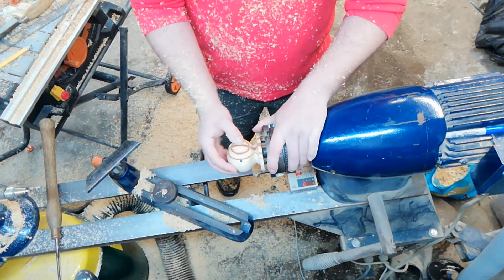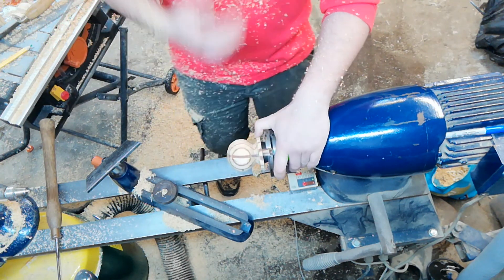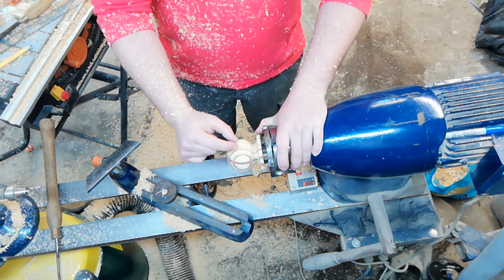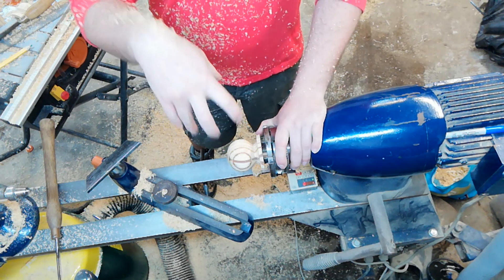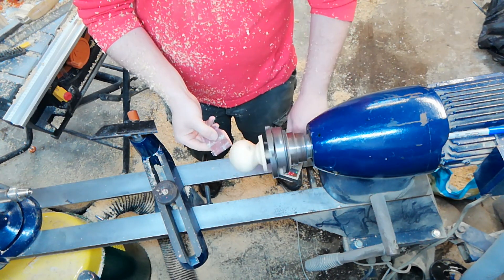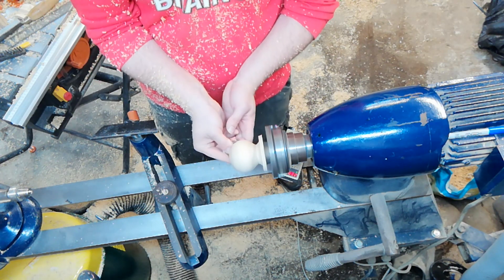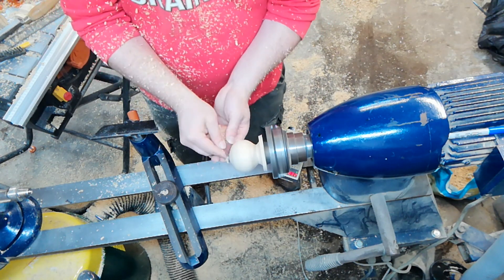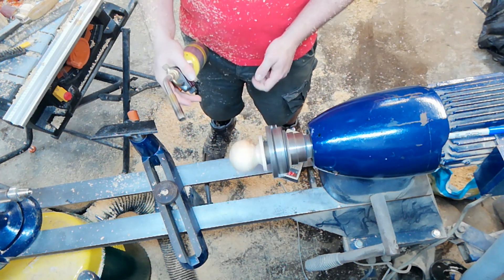What we're going to do is really accentuate this grain — you can see we've got a resin pocket there. We're going to use the blowtorch to bring out the summer and winter growth. The sapwood white portion is the summer growth, because trees photosynthesize more in summer; this darker growth is the winter growth, which tends to be more compressed and hardy — that's what will stay after blowtorching. Before we blowtorch, do some sanding with 240 grit sandpaper, coming from underneath when sanding. Then turn the speed down, make sure you've got a fire extinguisher to hand just in case.